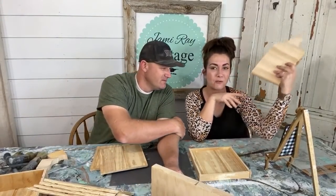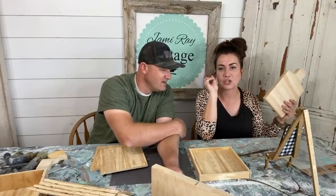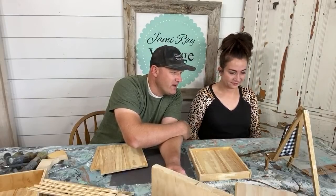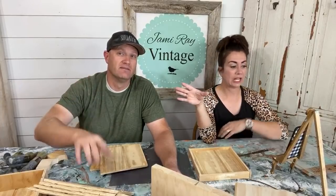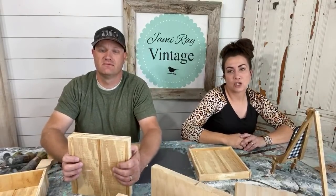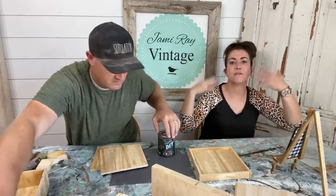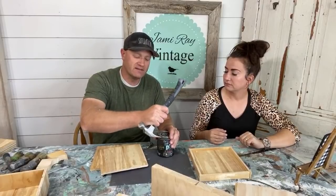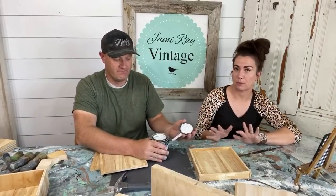When you come on, just say hello and ask questions. Caitlin Chambers is our moderator — she knows all the things. Quick question from Wendy: anyone having trouble spraying DIY paint with an electric sprayer at a two-to-one ratio? Two-to-one is going to be too thin and runny. It should be three parts paint to one part water. Make sure you watch our paint spraying videos — search Jamie Ray Vintage Spray DIY Paint. Shake the paint really well; that's the biggest thing. If your electric sprayer can handle regular paint, it can spray DIY.